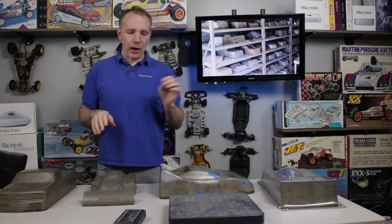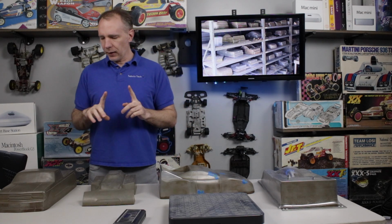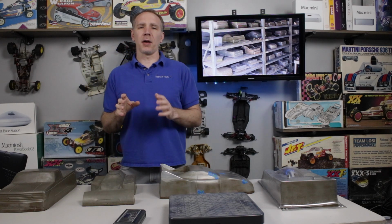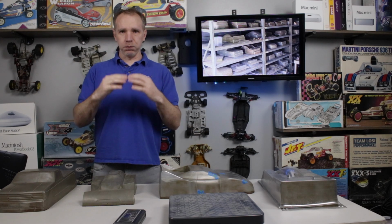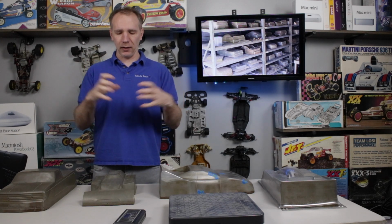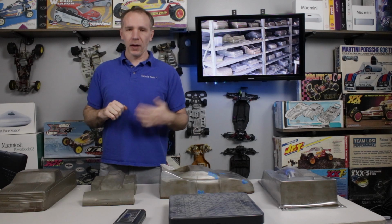Can't help it. Now, we have some forms that were reproductions of companies' bodies that were made a long time ago that are no longer around anymore, or they aren't making them anymore. One of the things is they were apparently made with a particular formula from a particular manufacturer that is not very heat tolerant in some cases. You can see, if you get the buck very warm with the heat gun, it starts to bubble or rise up in spots because that resin is expanding under heat. That is because it most likely has a lower content of aluminum in it, plus it may be a blend of epoxy that is not as heat tolerant.